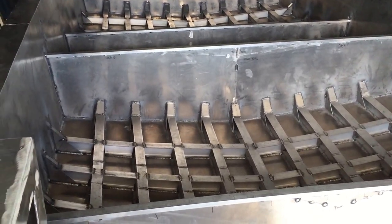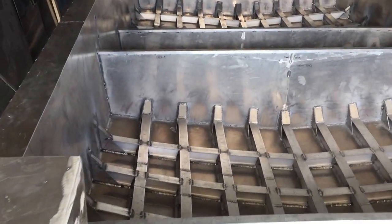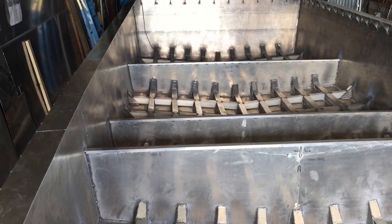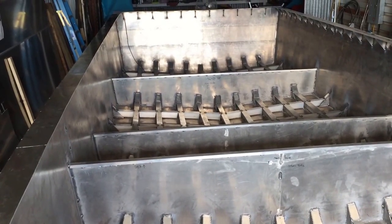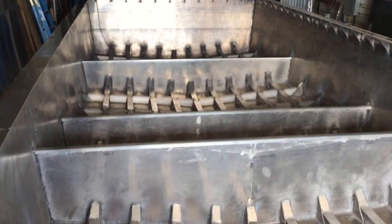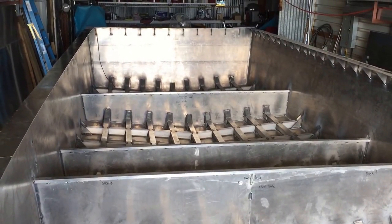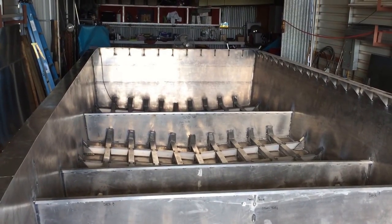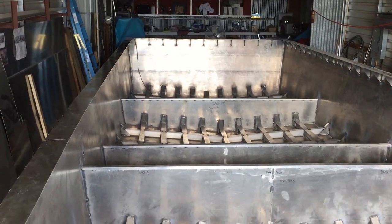Those next three spaces inside the cabin won't have a welded solid deck, so I'll put three different bilge pumps in those areas with automatic floats. I'll still put those little service ports — a smooth round port that mounts on the deck, you unscrew the lid and take a look in there. They're pretty handy — I'm sure you've seen them on lots of boats. That's the flotation plan for a boat like this.